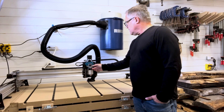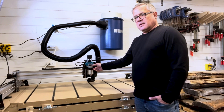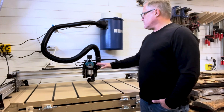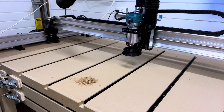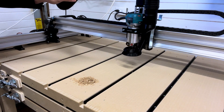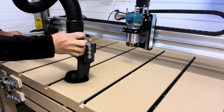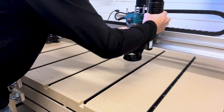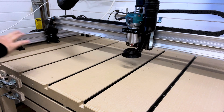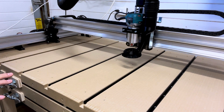So if we turn the spindle on — you can hear there was a delay between the spindle stop and the vacuum stop. I can also override the vacuum switch by turning the iVAC switch to on, and the vacuum will automatically come on. You can see I've got some dust here. As you can see, the setup is very powerful and all the dust was cleared away. When I did the spoil board to make it a flat surface, there was no dust left on the surface.